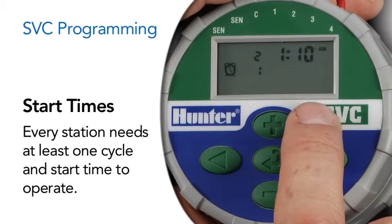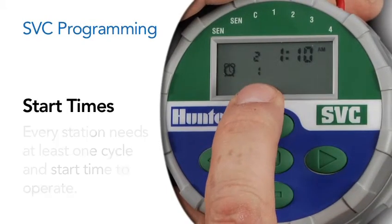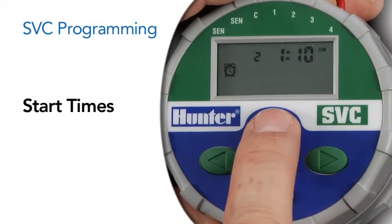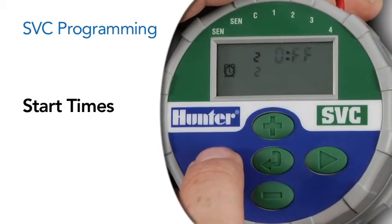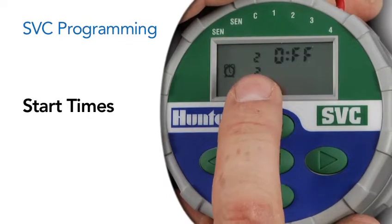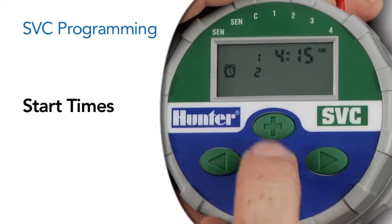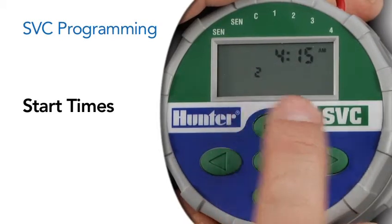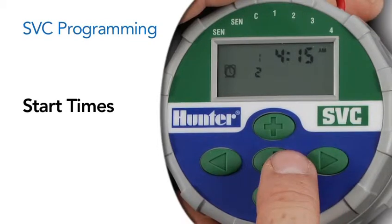Every station needs its own cycle start time. So I'll use the left arrow and drop down to the station number, and I'll use the plus button to advance to station 2. And this is cycle start 2 for station 2. We'll use the minus button, go back to cycle start 1 for station 2, and it's starting at 4:15 in the morning. We'll leave it how it is.